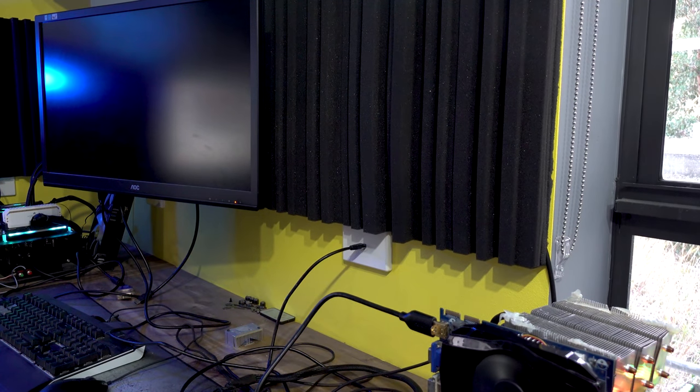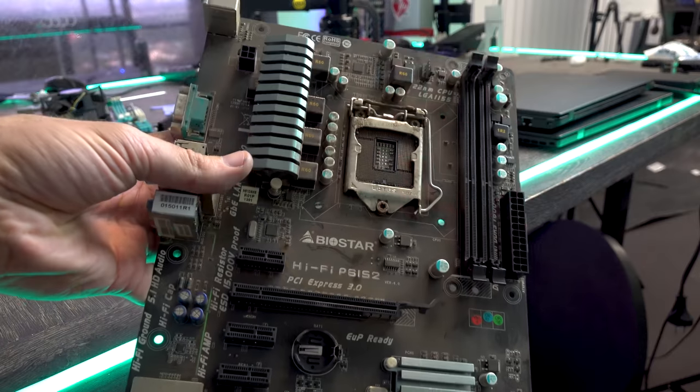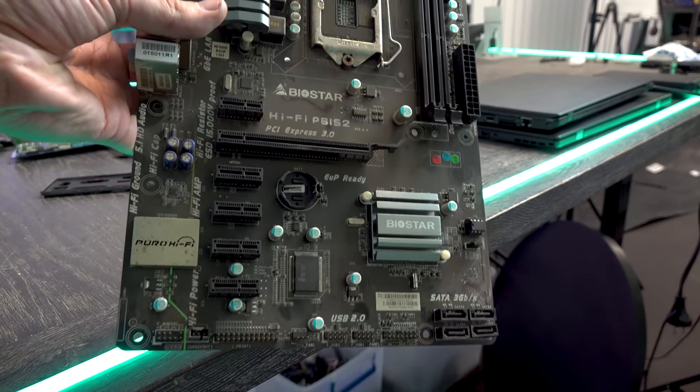The MSI H97, when we turned that on, it just switched quickly on and off. So something is inherently faulty on that board to the point where you're going to have to replace a faulty part on it, because it would just quickly go and then it would short out. And then if you tried to turn it on after that, it just wouldn't turn on at all. None of the diagnostic lights worked either. This was just a completely faulty board. The good news there, we've got 3 of 5 boards working.